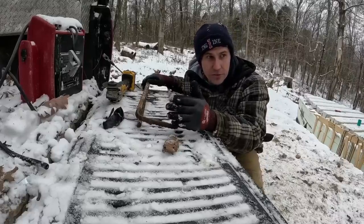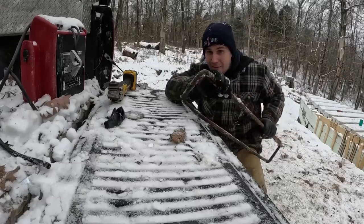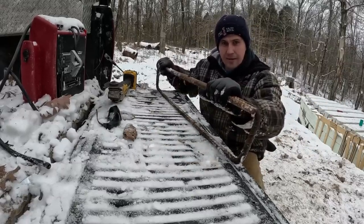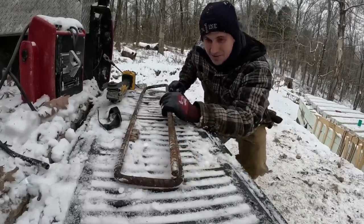I used 8 when I should have used 6. This isn't the deeper beams. This is the normal beam pocket. But there you go. That's a beaut, huh? And we just tie wire that together. We'll flip it so the double bar that's overlapped is on the bottom. That'll do the trick.